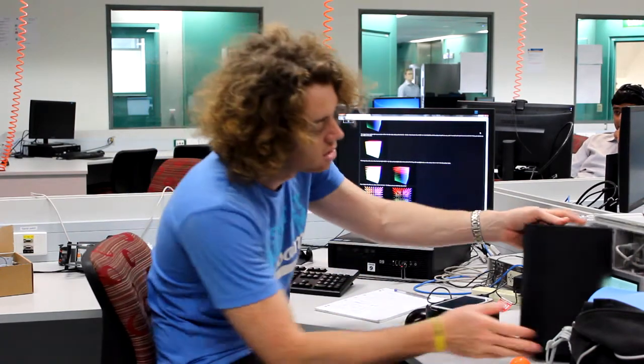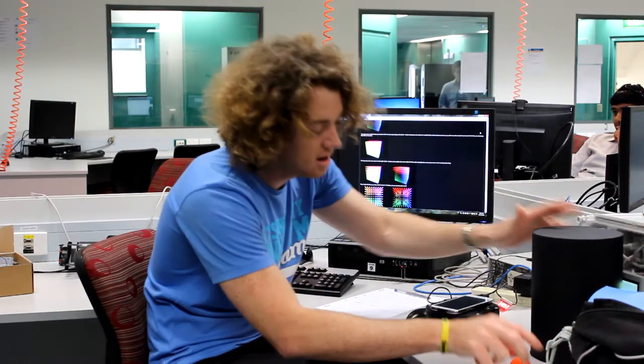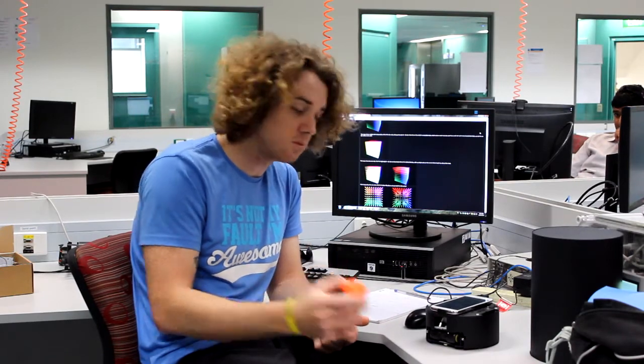It was a decision of the group to purely use vision as a means of navigation. The robot would have to segment out colours and decide on the fly what to do with those colours. For example, the robot would have to avoid all objects of the colour black, and would have to be attracted to all objects of the colour orange, which represents the ball.